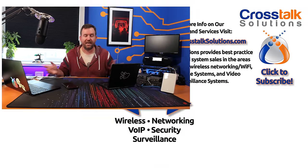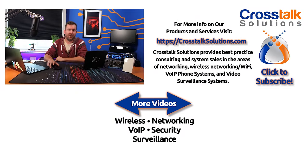That's where we're going to stop this video. We have set up three different networks — a secure network, an IoT network, and a guest network. The guest network is completely client-isolated, the IoT network cannot see into other networks, but the secure network can see into the IoT network with no problem. We have three wireless networks, one corresponding to each wired network. There's a lot more configuration that can be done for any SDN such as TP-Link Omada, but this is a very basic setup where you can plug in all your devices and be confident everything is set up properly and securely.